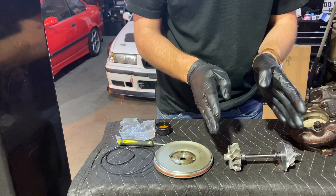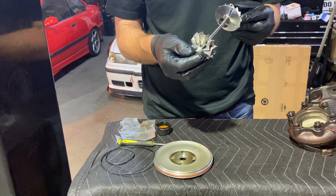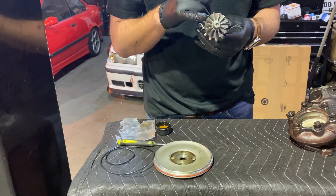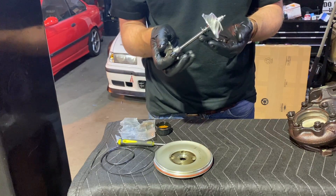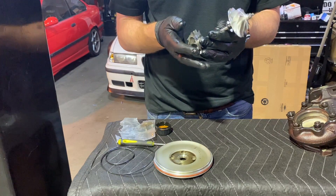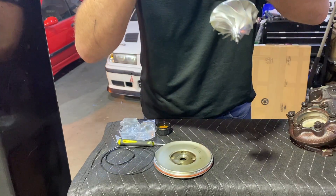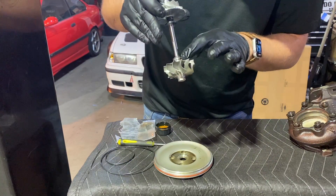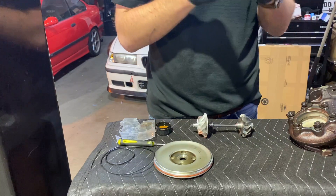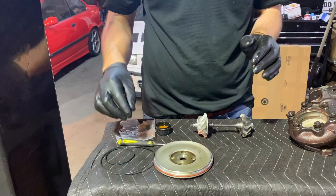This shaft has been beautifully cleaned by Vargas Turbo — they cleaned all the deposits left on the blades. The shaft had a bunch of oily residue, so they not only balanced it — I have a picture of that — but they also gave me alignment marks: black marks all the way across these bearings. That's how they recommend installing it back into the CHRA to ensure everything is as balanced as possible.